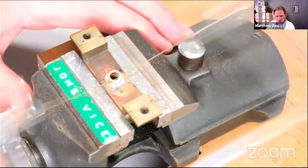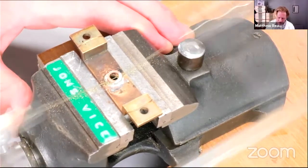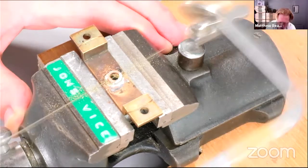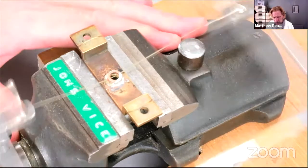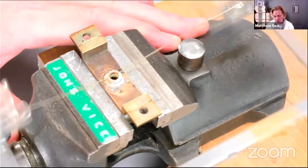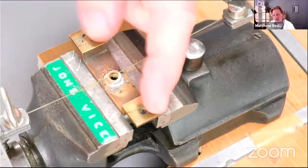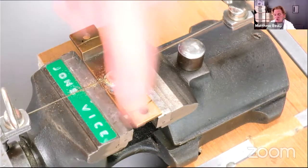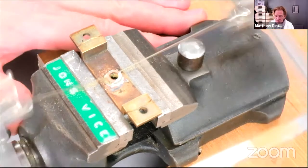The piercing saw blade's gone blunt, but in a slightly Yorkshire bloody-minded way, I'm going to try and get through it with this one. Just check them up. Sawing there, that's fine. Yeah, I think we're going to be able to hold this in the lathe. Don't quite know how. If you've got a lathe with bigger collets, you can just stick the whole thing in a collet. And, anyway, I don't. Or put a bit of wood in the 3-jaw chuck or 4-jaw chuck, bore a hole in the middle and screw these two to the face plate or the bit of wood. And then you can turn and do what you want.